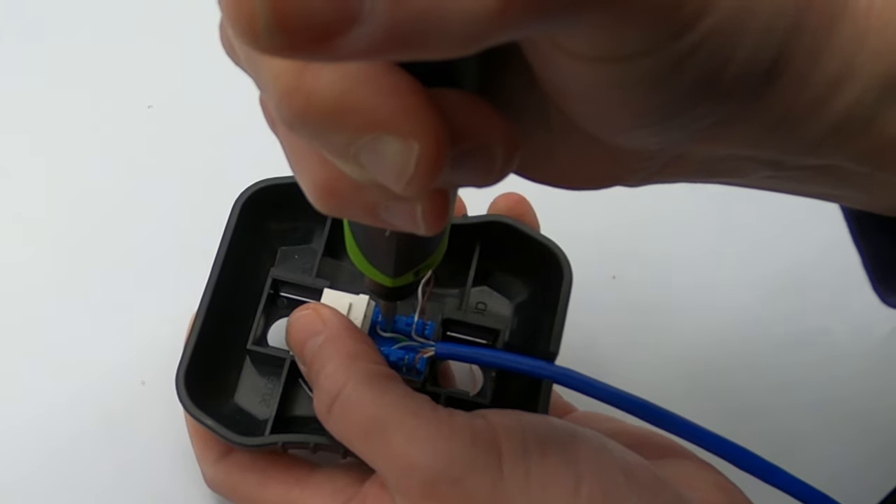The next step is to make certain that all of the conductors are fully seated — and they are — and that they're all flush cut off. Then just put on that plastic IDC cap like we did before and you're all ready to go.